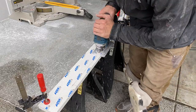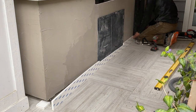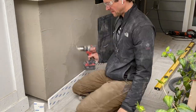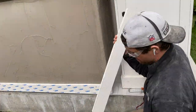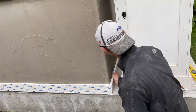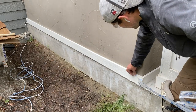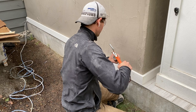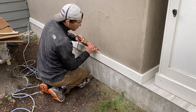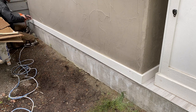When fastening the cortex fasteners into the cabinet, remember to pre-drill your hole first because you're going through aluminum and these screws are not tapped for aluminum penetration — but if you pre-drill, they fit with no problem. Make sure to remove the layer of protection on the trim before painting. I run a bead of high quality paintable caulk around the entire perimeter of the trim for a crisp, clean line all the way across. Keyword: paintable.